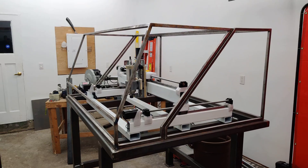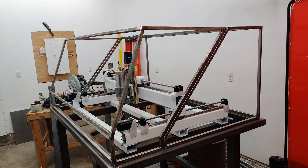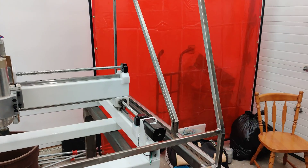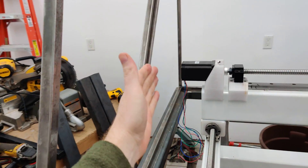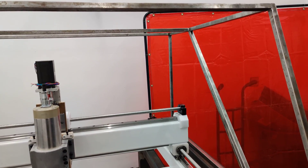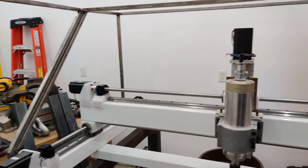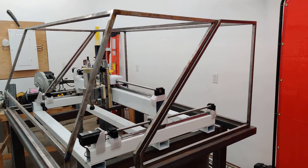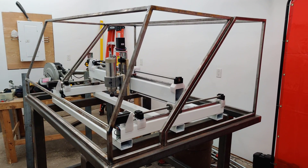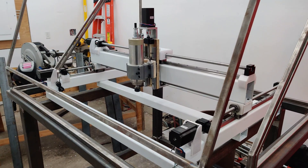For finishing up the enclosure, the front face will be polycarbonate or Lexan. Instead of doing stainless steel on the inside — because it's going to get really expensive from what I've been pricing out — I think I'm going to go with aluminum, probably the same gauge as what they use on signs. It's thin enough but rigid enough to retain its shape. And what's nice about aluminum is it's a lot cheaper, I don't have to worry about painting it, and it won't rust — it'll just get its oxide layer and be pretty immune to all the liquid from the flood cooling system.